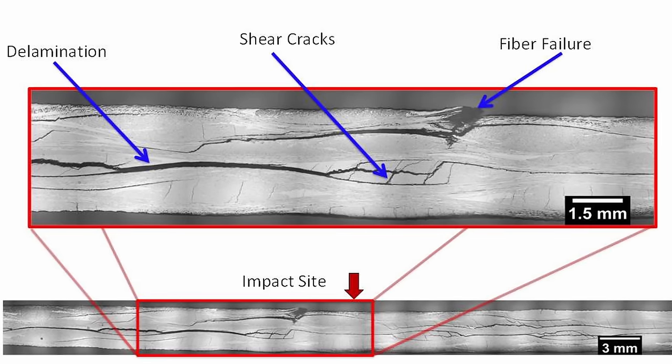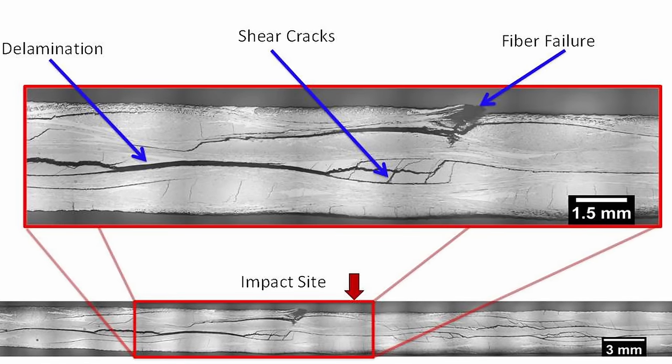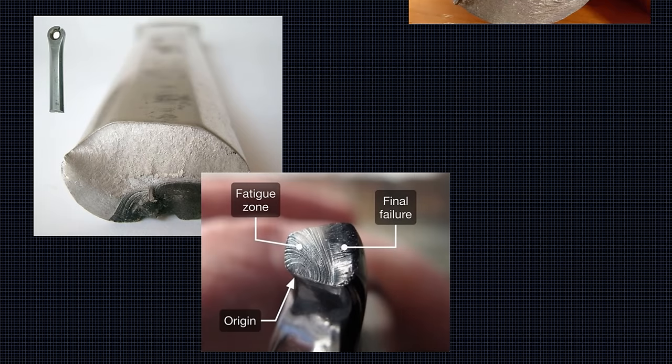This was an extremely important consideration because composites tend to be very stiff and brittle, and when they fail, they tend to fail catastrophically. With metal, you may catch the micro-cracks while they are forming, or you can see some permanent strain. Composites do not warn you as early as metal.